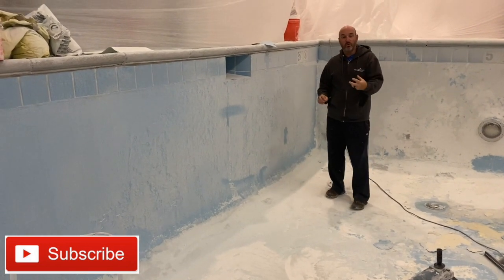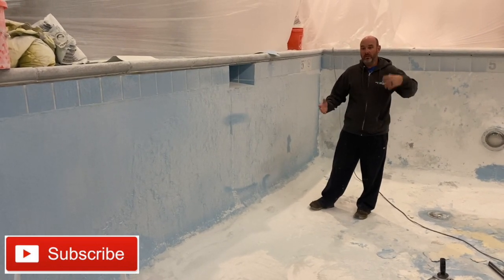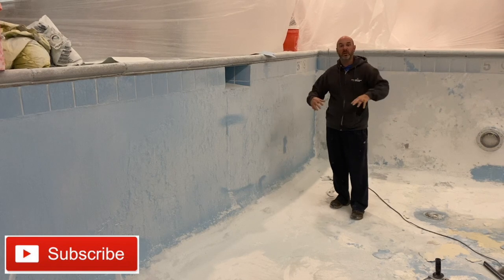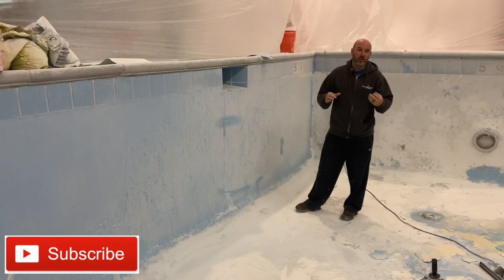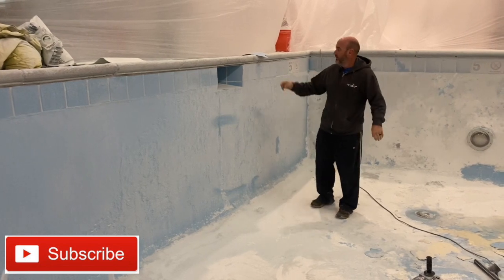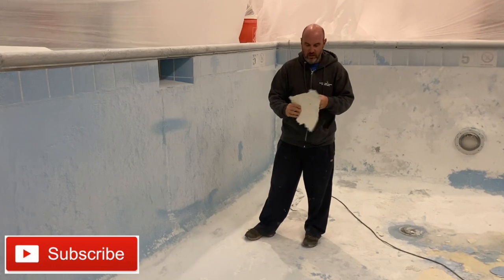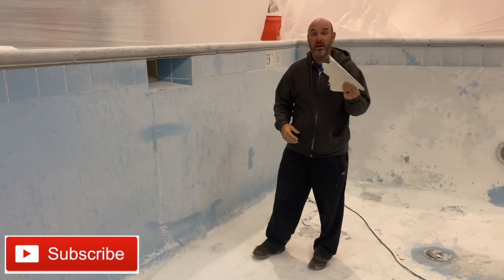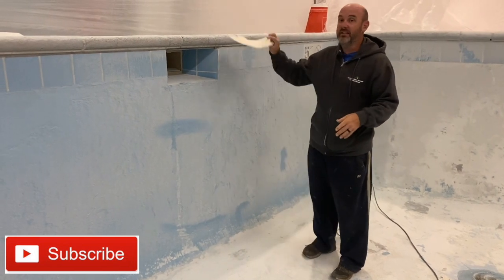A lot of these hotel pools, after the plaster starts to fail, because they have a lot of chemistry swings with all the people and just all the traffic they get, they will take the cheap way, which is epoxy coating. And from the look of this old epoxy that's just peeling off in a lot of areas, there's at least 3 or 4 layers of epoxy that we're cutting through. So it doesn't last very long.